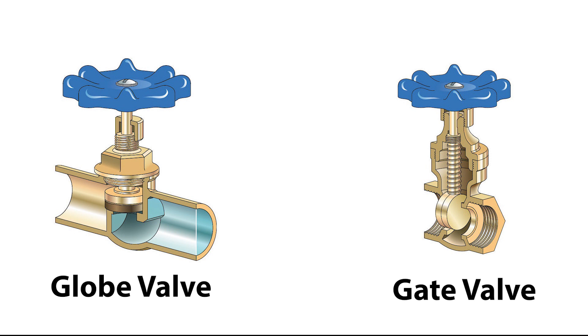This is not a permanent fix because the rubber o-ring inside the valve has probably deteriorated over time. Over many years, it's either worn off or has broken, so that's what needs to be replaced — or replace the valve entirely.